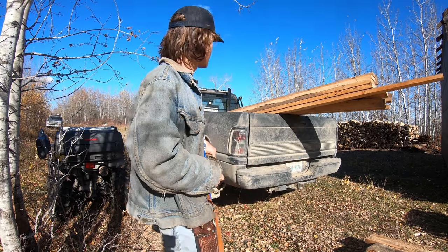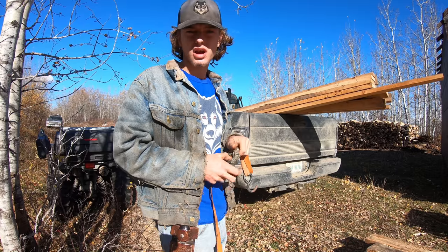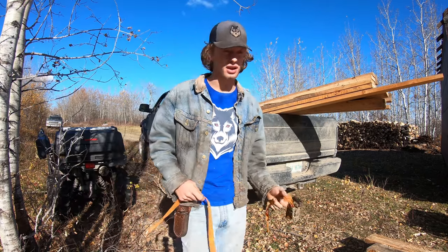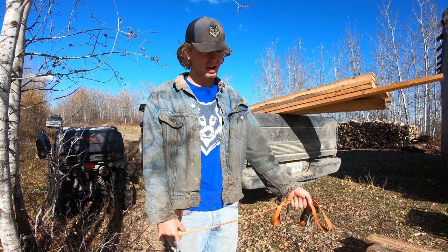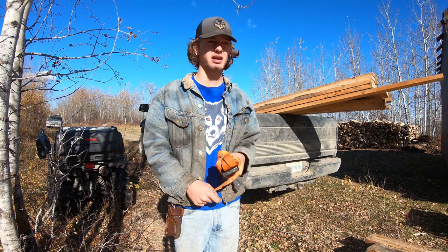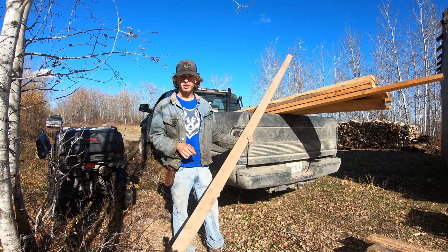This is all going to work out real good because I already have insulation for 24-on-center — I already have two kinds of insulation, I'm not getting three. And then I'm also going to use these rough-cut planks — they're 2x8s, they're solid — and lay them on top. That way, I didn't have to pay lumber tax on these either. So it's going to work out real nice, it's not going to cost very much to do at all. We're avoiding lumber tax like the plague here. Some of these have bends in them, and I'm just going to put them in the center — it'll be good.